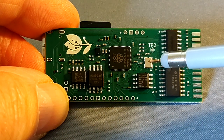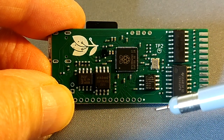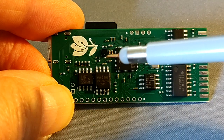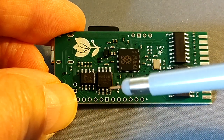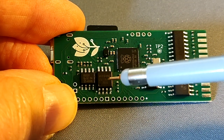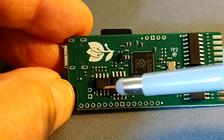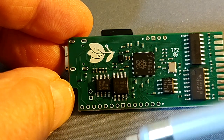This is the 12 MHz crystal for the processor, and here you see the real workhorse, which is the RP2350 processor. It has its own internal 1.1 volt regulator, and for that a very custom inductor is used, which is this one. Other parts are the flash memory. This is 16 megabytes of flash memory directly connected to the processor, and here is the real-time clock. The real-time clock is used for time module emulation. The firmware is not prepared for that, but it's there anyhow.